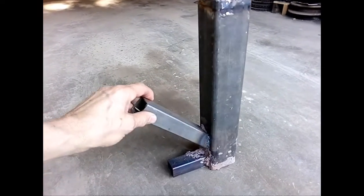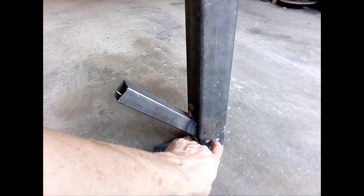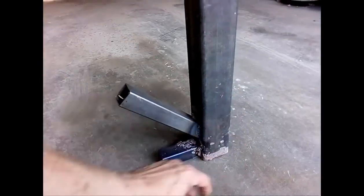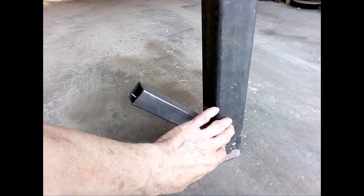The other problem is it's really hard to light, right? So in here I've got an angle cut, and I put a little screen in here, and all it did was clog up. Not a big enough firebox, and I couldn't get it to light up and flame well.